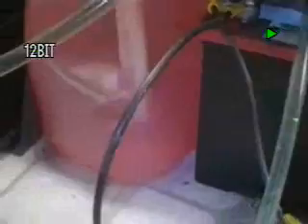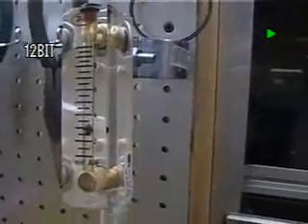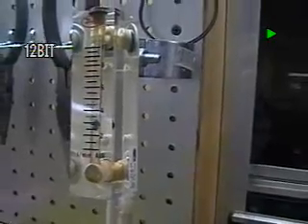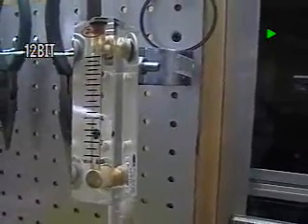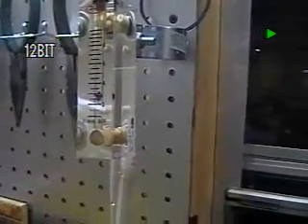If you look down below, you can see the gas coming out of it right there. And if you look closely at the hose — right up on top — there's not a bit of condensate in the hose going up to the flow meter anywhere. No condensate, no moisture, no nothing. It's been running 13 hours at 15 amps, producing 3 liters a minute static, not under vacuum. Right now it's pushing over 2 PSI; when you put it into a vacuum from an engine, the needle will actually go up.